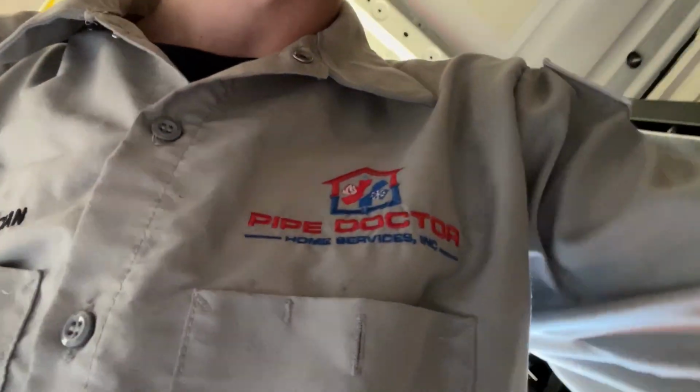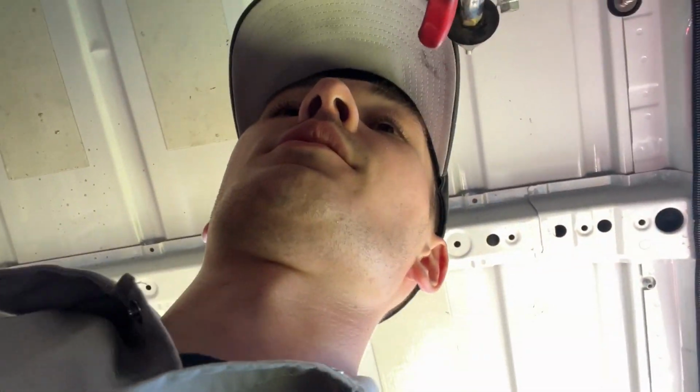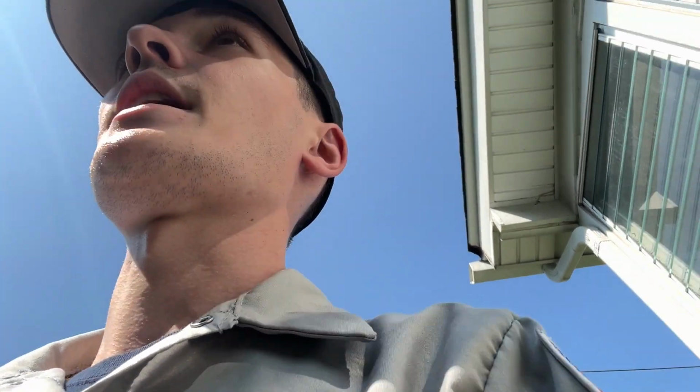Okay, I checked power, contactors, capacitors, but I'm not thrilled with the pressure on the first floor system, as far as having a fairly high to decent superheat, but a low subcooling, and our evaporator temperature is slowly starting to go down. I had to add a few pounds of refrigerant last season. He's going to go ahead with adding whatever I need to add here. So I grabbed my 410, my scale, and I'll get ready to start charging it.